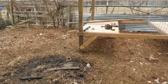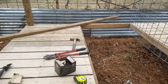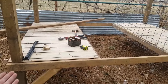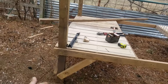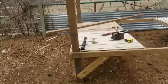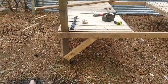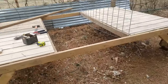I'm just gonna go down and explain what's going on now and start from here. This kennel is nine feet across, six feet wide. The height is four feet, the back is three and a half feet. There's an incline so there will be runoff when it rains. These bracing pieces were just scraps — I measured them out at a 45-degree angle, cut them off, and put them all on.